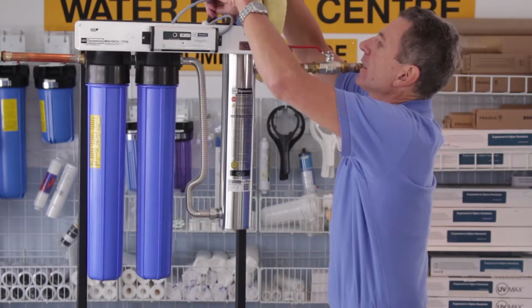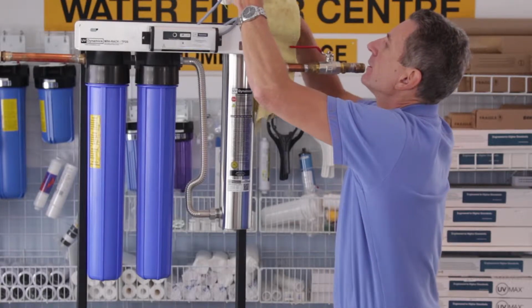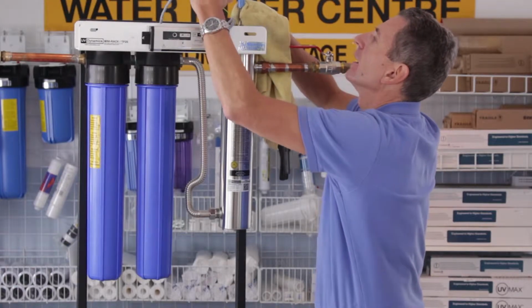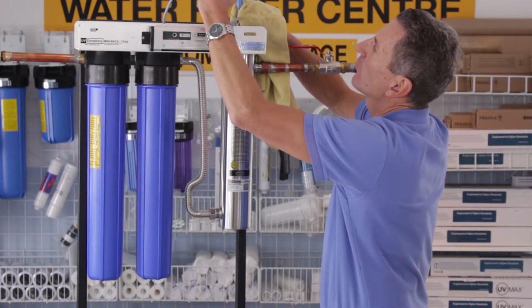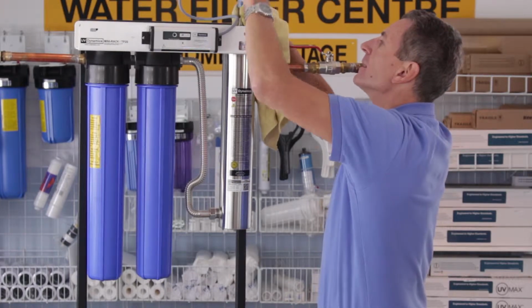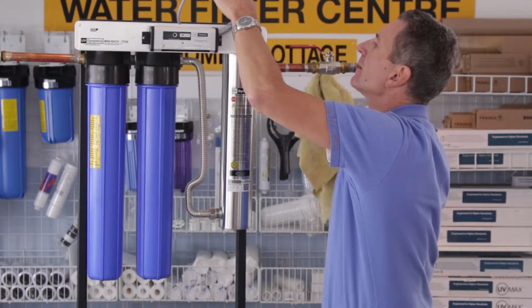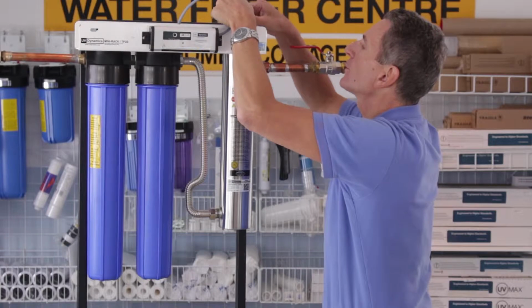Okay, so there again we can slide in the lamp. Bring it down, and then there's two ways the lamp can go. There's 4 pins, but they're set slightly further apart one direction than the other. So then you slide the pins inside the electrical connection. Slide that down. Push it all the way in.